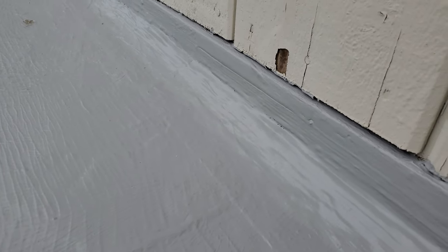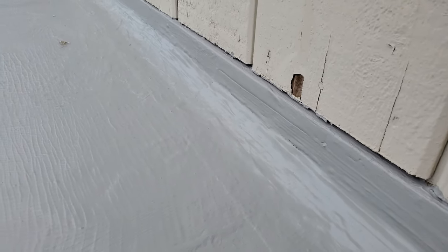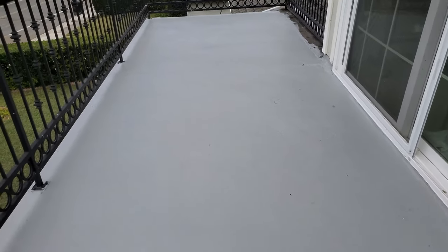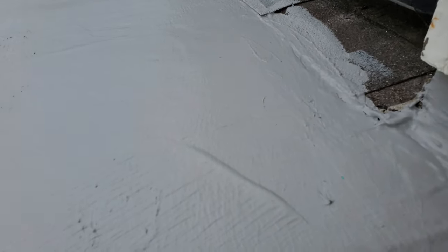It is the next day. Since it is a liquid rubber, it's real thick and difficult to get some areas smooth — you can see all the ridges in the corner and the brush marks on the floor. I was using a smooth roller too, but it still came up with texture. For safety reasons that texture is probably better anyway. Just don't expect to get it completely smooth as if it were paint. Also be mindful to identify any mounds of material before they form — there were two spots at an angle that were very difficult for me to see.